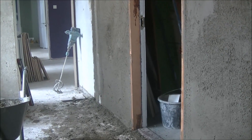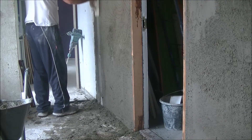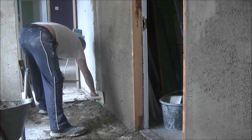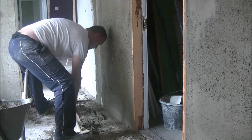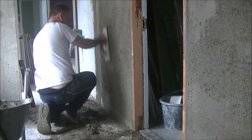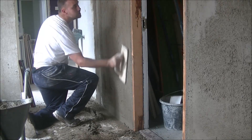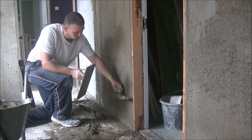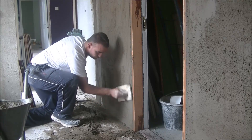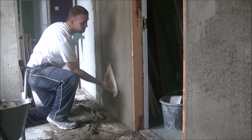We're really getting places now — the top is done. I like to clean my angles as I go, which is why I always keep the trowel in my hand. I also use the trowel a bit like a hawk — you can nip a wee bit of stuff on it and fill holes as you float. On a wall like this I pay particular attention to straightening it as neat as possible. If the cement is really starting to set and pick up, I can rub it much quicker as it's neater, so the float goes around it quicker.